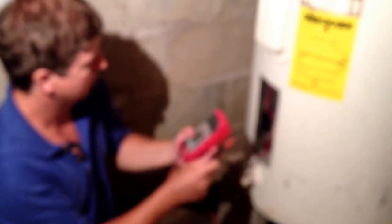I'm going to show you how to check those with a multimeter. First of all, you want to make sure you got your breaker turned off. Always take a meter to double-check — which I'll go ahead and check this one here. As you can see, I've got no power there.